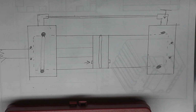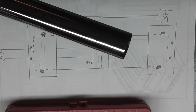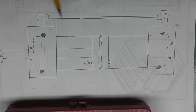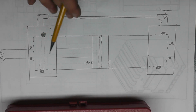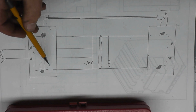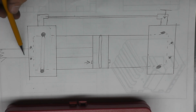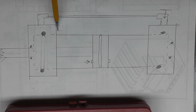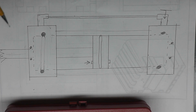This inner tube here is going to be made out of 1.5 inch OD. This is a drain tailpiece for a sink. And then here's our needle valve, and here's just a compression 90 with a connector rod. Our piston, which is right here, can be made out of anything. It can be made out of brass, aluminum, steel. We'll probably go with aluminum. And like I said, our end caps are 2-inch aluminum square, and our shaft here is a 1/2-inch drill rod. And then we'll also have 4 of the threaded rods to bolt those caps together there.